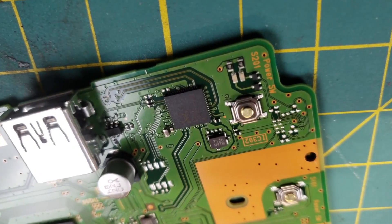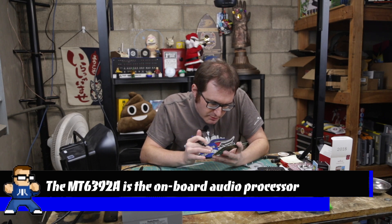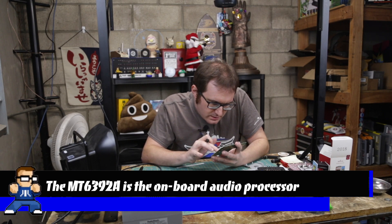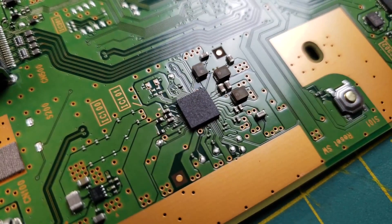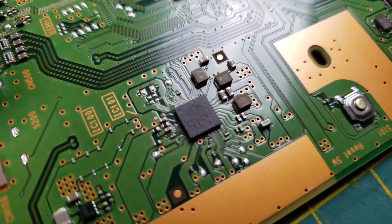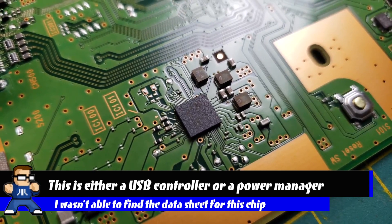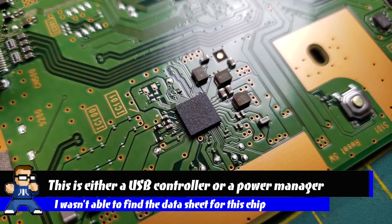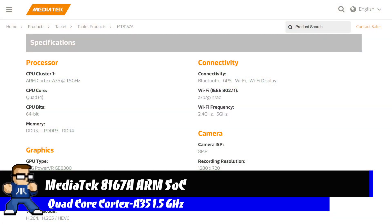A little bit further in here we've got the MediaTek MT6392A chip — I'm not sure what that one's for, we'll find out later. And this is an RT-55482 chip, which looks like it's probably a USB controller, but we can't tell. Here's the main processor — it's an ARM processor, the MediaTek MT8167A. That's the main processor there.